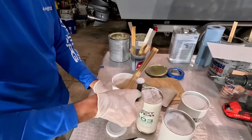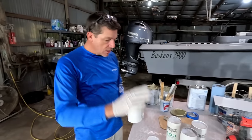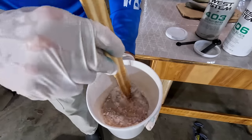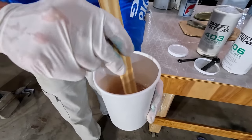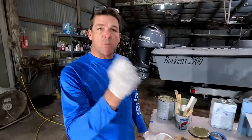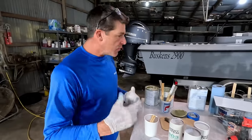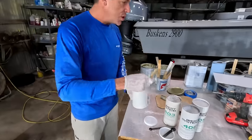And this is a really good way to make your own fillers. Now, you can also do this with epoxy resin. Y'all will notice that we're using the West Systems, but a lot of these additives will work with a polyester resin as well. You notice I'm just doing this nice and easy. You can see that's thickened up considerably. And remember, you can do this with gel coat as well. And so a lot of times if you've got a deeper gouge, or again, going back to screw holes that need to be filled, if you have a factory match gel coat, you can add some of the colloidal silica or fume silica, microspheres. There's a variety of different names they use, and it will allow you to take a resin and thicken it up a pretty good bit.